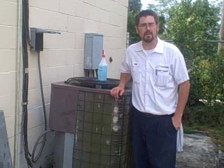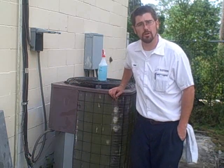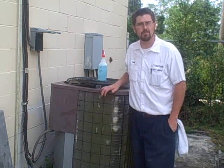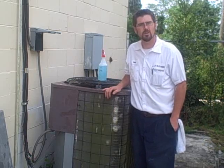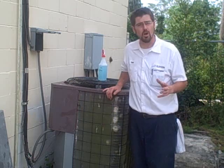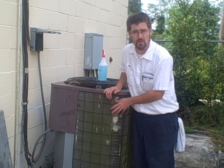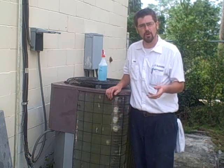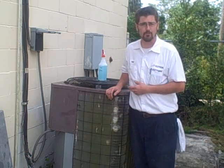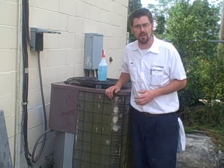In this part of the video, we're going to show you how basic cleaning of your coil with just a garden hose can keep it running at its best possible performance. Essentially, you're keeping it clean like the radiator in your car. When debris gets stuck on this condensing coil, it makes the system run harder, which shortens the life of the unit and raises your energy costs.